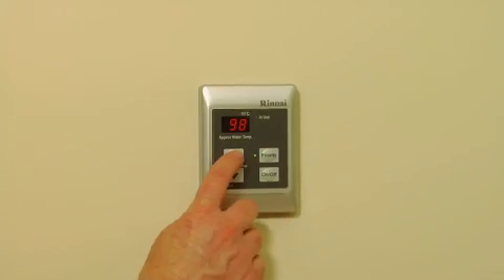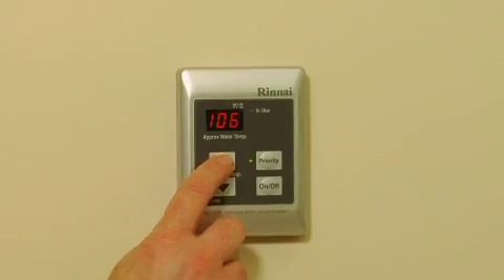We're here in the master bath where Mike has put the finishing touches on one of the controllers. There's one here and one in the laundry room. Both controllers allow you to set the water temperature from 98 to 120 degrees for that particular area. If you're using hot water, you push the priority button — that gives this controller priority over the other controller, and you can adjust the water temperature from 98 to 110 while the water is running. There's a scald-protection feature built in: with the water running, you cannot go above 110 degrees. That way, if someone is showering at 110, no one else can turn the water up and burn them. And for the laundry room controller, you can push the priority button to get up to 120-degree water for washing clothes or dishes.